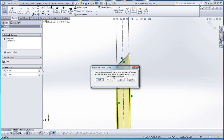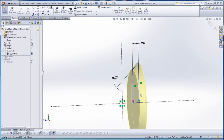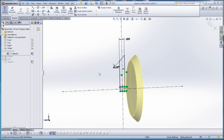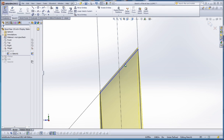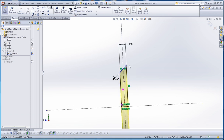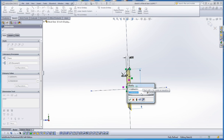Let me show you how we did this. We'll delete that and go back. With two vertical lines we don't have that established as being in the center, but we can right-click on this line, select the midpoint, put it right in the middle, and make that coincident. Now we have the top of that line which has got that bevel - that chamfer. A good way to do that is put a point up there. We'll take that point with the control key pressed, clicking that center line to make those coincident. The only thing left to define is the actual distance - we click that point, click the center line, and keeping our dimension on that side of the line makes it a diameter. We put in the value of six.